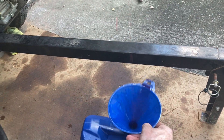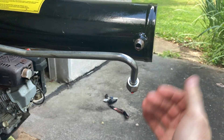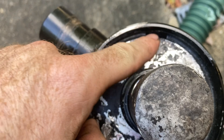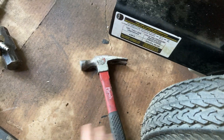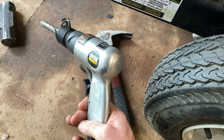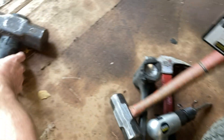Since it's clearly leaking, there's nothing to do but take it back apart. This time I'm saving the fluid properly. I've got to line off the cylinder so when I push on it the air has somewhere to go. I'm guessing the moron I hired to weld this overheated the cylinder and cooked the seals. You've got to pound on the gland end to pull out the snap ring — once that's out you can pull the whole piston right out. I've used every trick I've got and that gland end will not budge. Bearcat doesn't stock seal kits for this three-year-old splitter anyway, so I'm still screwed. I'm going to have to take it to my buddy's shop and let professionals handle it.